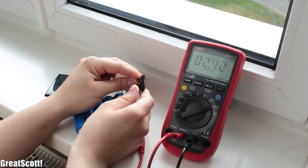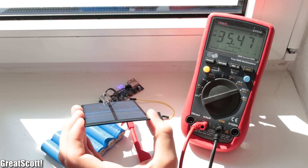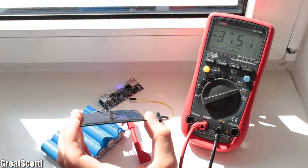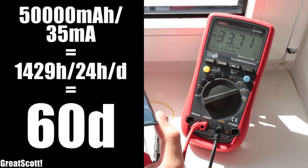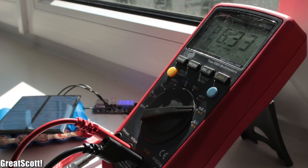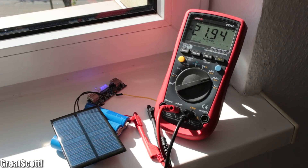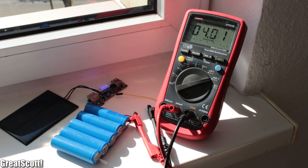Next let's see how useful this polycrystalline solar panel really is. I connected my measuring equipment and positioned the panel to get a maximum battery charge current of around 35 mA. So it would take around 60 days of continuous sunshine to charge the whole 50,000 mAh battery — that is just ridiculous and is only a way to trick people into thinking they can charge this whole thing solely by solar energy. Even worse, there is actually a charge state where it drains the batteries while claiming it is recharging them.